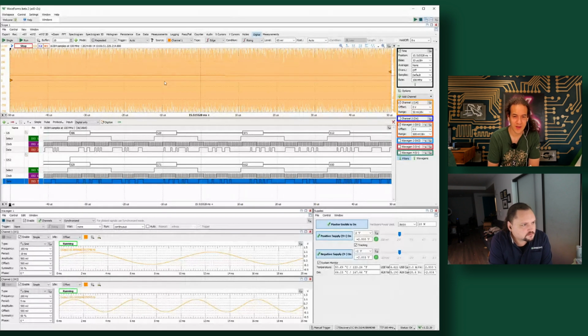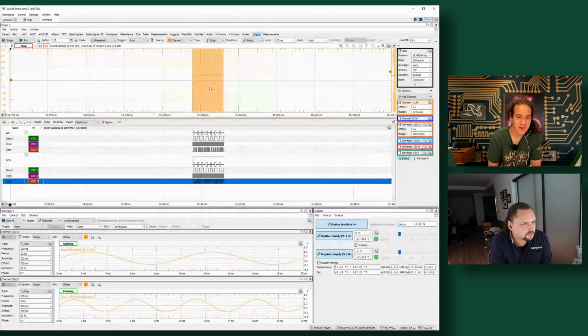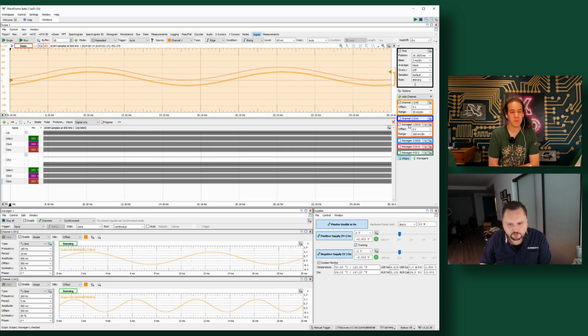Cool. And I guess the top one is the audio trace being read in. Yep. That is the actual analog audio data from the connector, plus an interpreted version of the signal that's going into the FPGA. So we are using, that's not correct, there's WaveGen 1. So we're looking at the WaveGen output going into the PMOD, and then the analog output as well. So it's input, output. We can compare the two and see how they differ.